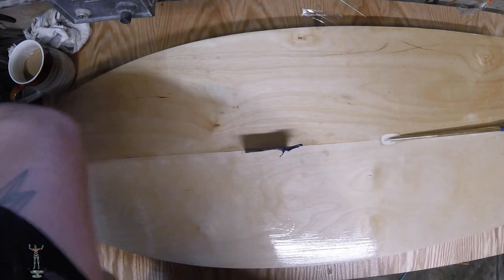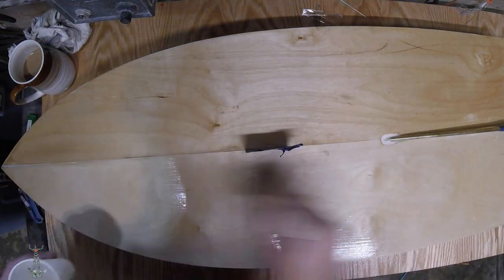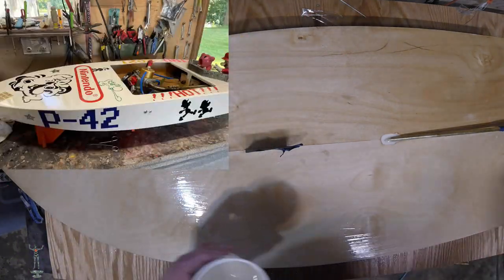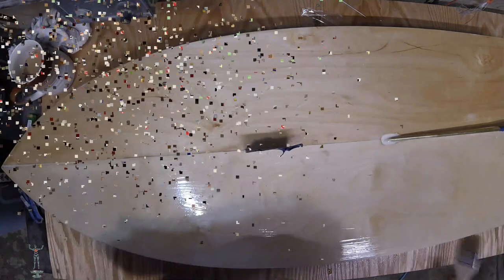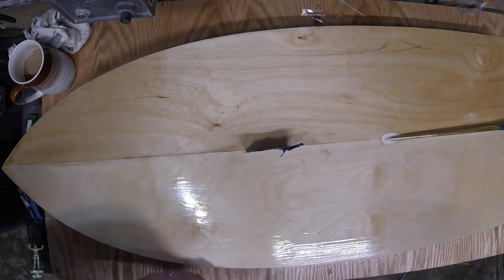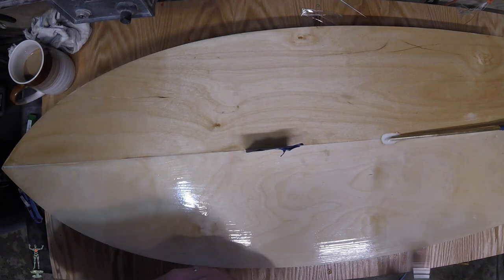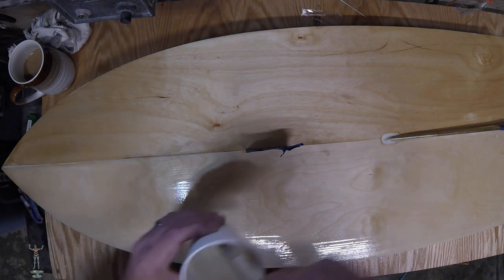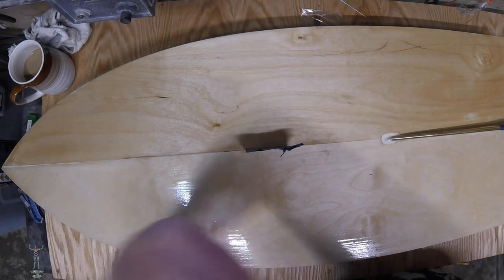I'm painting this a very light color. We're painting this boat white. This is the Nintendo boat replacement. Okay? Lighter colors show less defects. That's why I hate painting black. You want to see how bad of a sanding job you did? Paint it black. Man, I'll tell you what. That pops out like an ugly girl at prom.